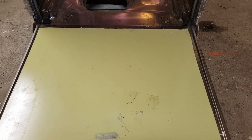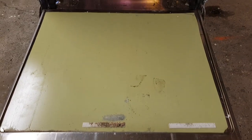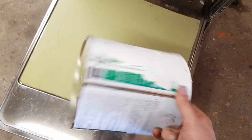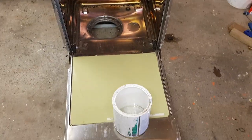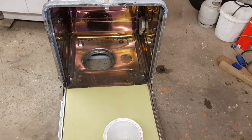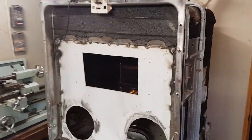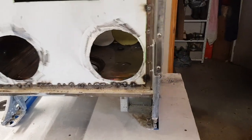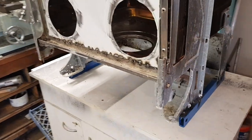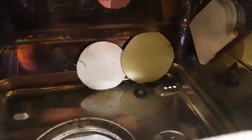Front door going on there — that's actually a piece off the front door cover. I'll just try and tack that in and glue the gaps, then fit the glass in the front. For the glove rings, I've just got this old paint can — I'll cut that open and then cable tie it over, and that should be enough to get it done. It's not ideal, but this isn't about ideal — this is about working with what we've got. Got the holes cut in, ready for the glass to go in with the glove rings. You can see the drain hole down there. All I really have to do is plumb it up — put in a couple of holes for the air to come in and for the water to get run up from the reservoir, through the pump, and into here, then just put the nozzle on.